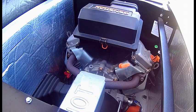And definitely no AC, definitely no water heaters. But this transfer panel on the generator has a load shedding option, which you can set up. If you've got 2 or 3 AC units and a smaller generator like a 16 kilowatt, you can shut off a particular AC unit or an electric water heater without overloading the generator. It'll do it automatically by shutting off the control relay.